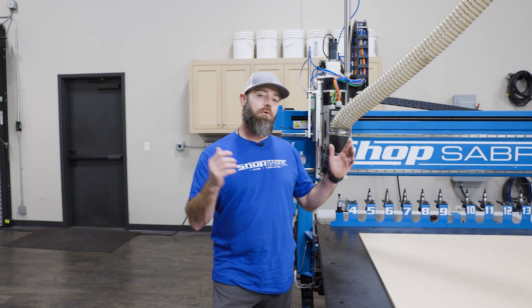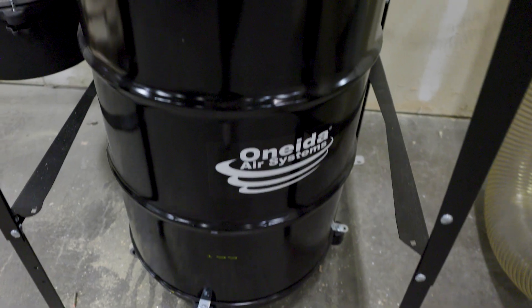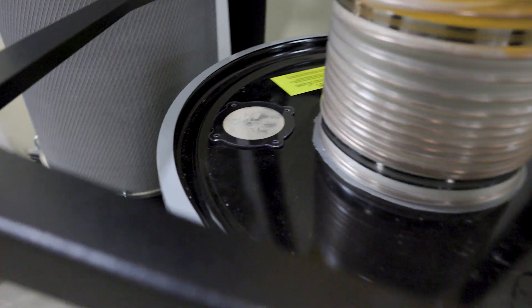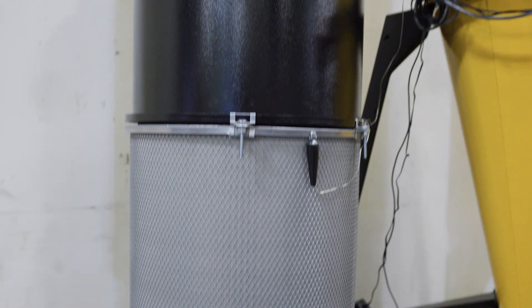It's given us the ability to leave ports open, we don't worry about loss in collection, and it works great. What we have is a freestanding unit with a 55-gallon drum. The drum has a sight glass on it, there's a bin fill sensor, a warning light, this is also a VFD StarGard motor, and when it comes to filtration, this has a HEPA-grade filter media to get down to those finest particles.